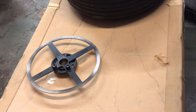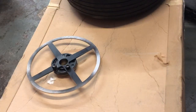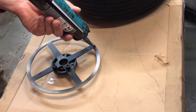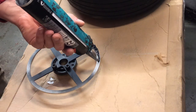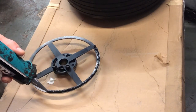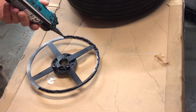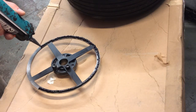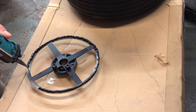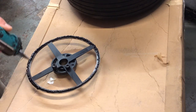I've added a bit of black spray so it's more difficult to see that drive sprocket behind the wheel. Then I'm going to stick it on with Sikaflex 221. This will add a bit of cushioning for the drive — not really a rubber cush drive but along those lines — and also dampen out a little bit of noise from the chain drive.